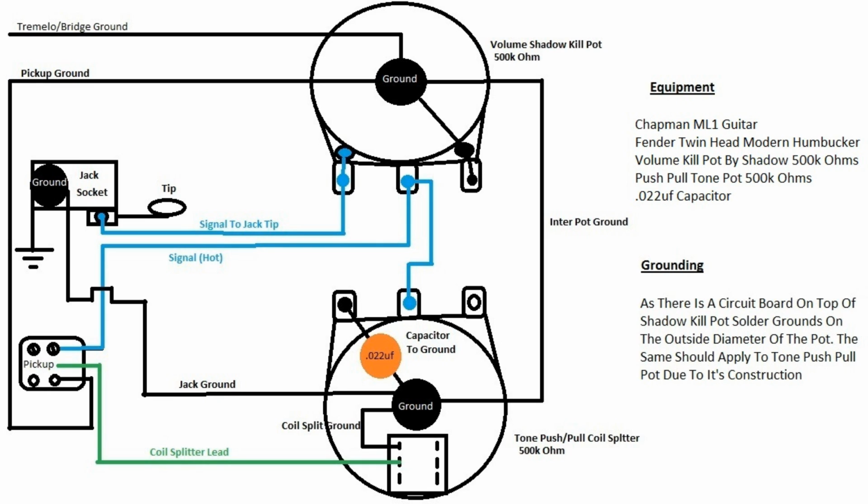Now, when your push-pull tone control is pushed in, that green lead is connected to the bottom terminal, which goes nowhere. So in other words, if you imagine your signal travelling from your slug pole coil, it comes up, it can't go through the green because the green's going nowhere, so it gets passed up to the blue adjustable screw poles, and then out through the blue. So it acts as a humbucker.